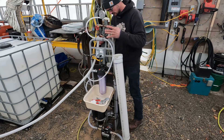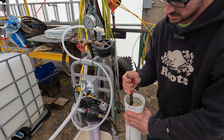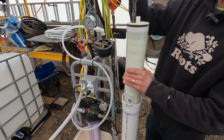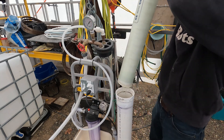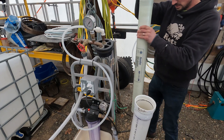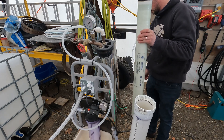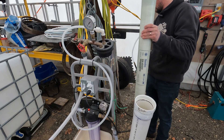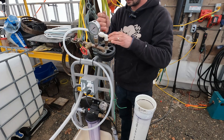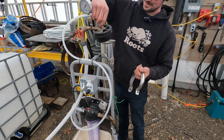So let's remove that. The easiest way to grab onto these is just with some pliers — grab onto the fin here. Don't grab onto that part because that's a sealing surface. Let that residual preservative drain out, then we'll reinstall the cap.